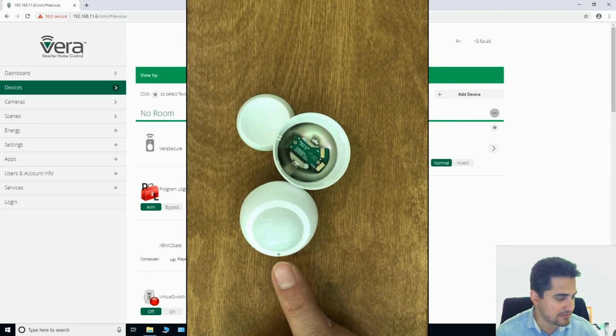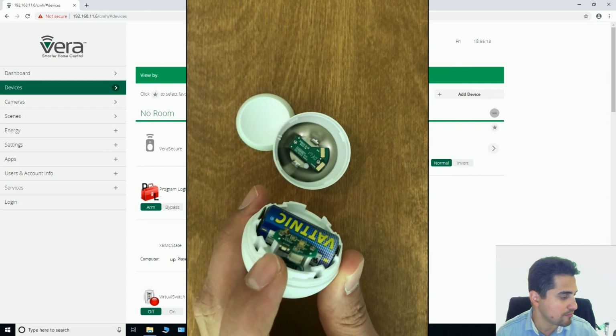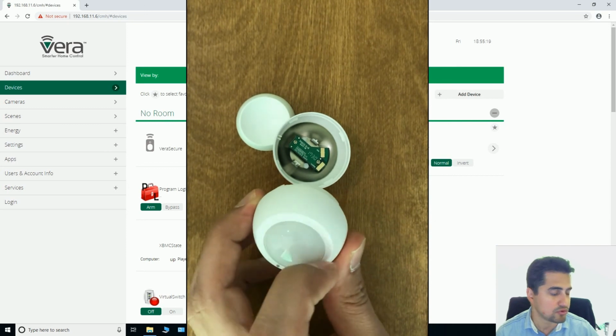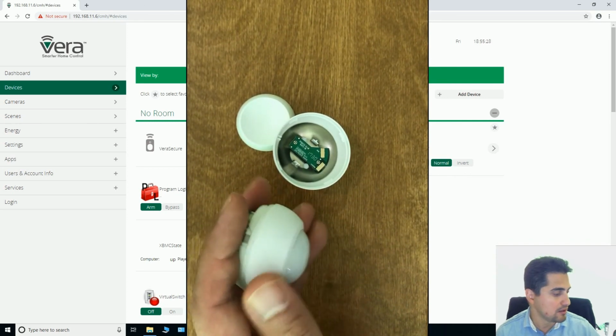Flashing like this means that motion sensor is in NWI mode, network-wide inclusion. In this mode, as soon as you enter your gateway into inclusion mode, sensor is added to your Z-Wave network. As I mentioned at the beginning of this video, by pressing Z-Wave button once, this mode is aborted. During this mode, you cannot reset motion sensor.